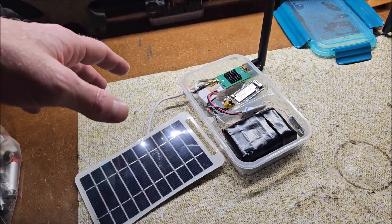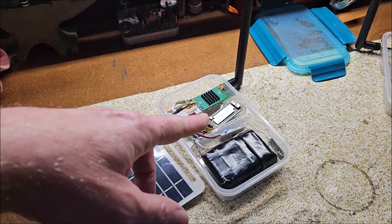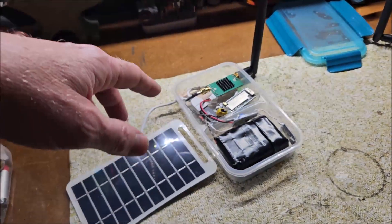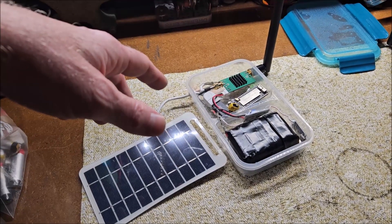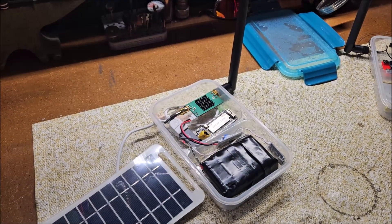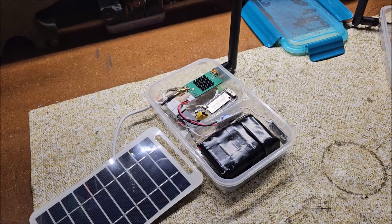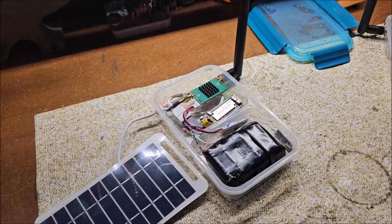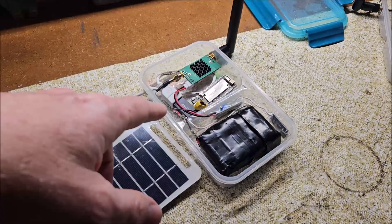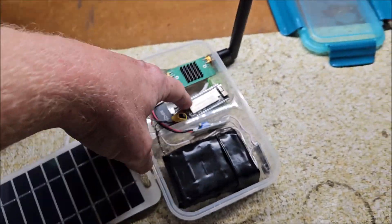I'm going to get into how I did that. At first I was looking at this board online and saw it had a five-volt pin, because this amplifier runs off five volts. I was thinking great, I can just run power from the board to the amplifier. I did that initially and noticed the light on the amplifier was only lit up when the sun was out. It dawned on me that I'm only getting five volts off that pin when it's plugged into USB, because I had the USB from the solar panel plugged directly into the board.